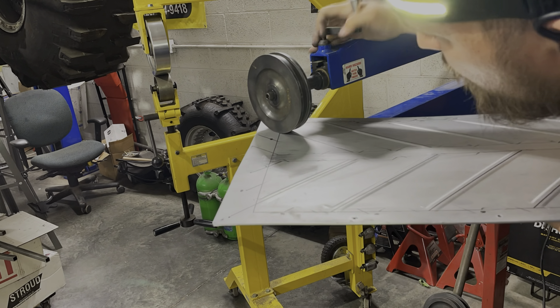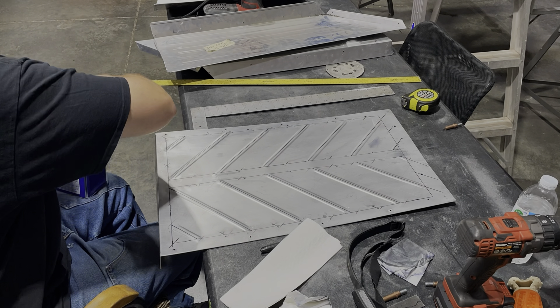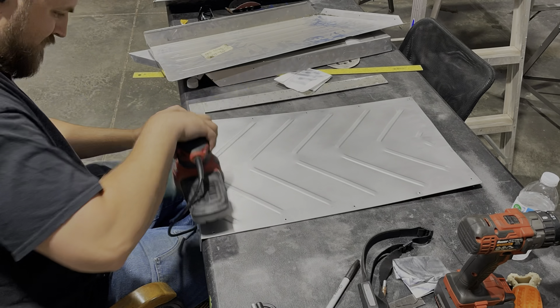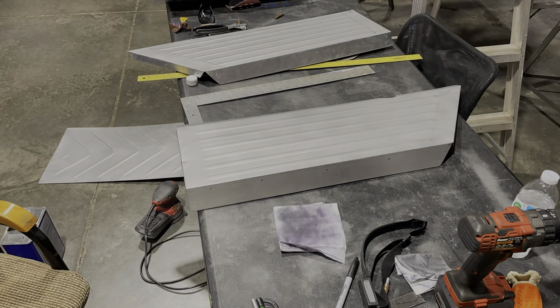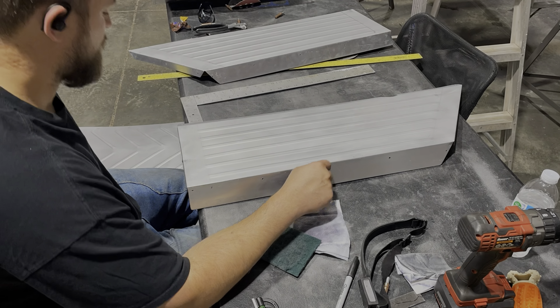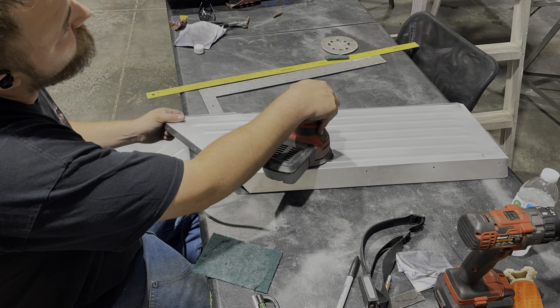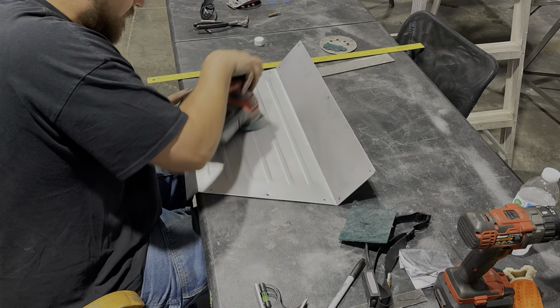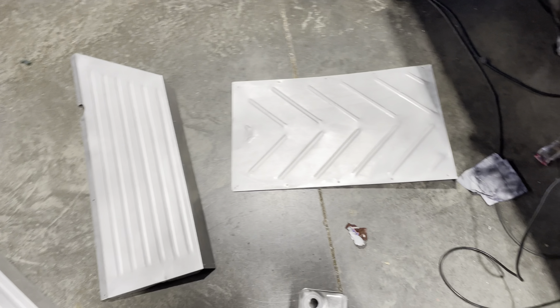If you've got a more complex piece, I definitely suggest going with triangles or different designs versus straight lines. If you've got square or rectangle pieces, the straight-line stuff looks pretty decent, or putting angles on it like this bottom piece here. Now I'm just cleaning these bad boys up, getting them straightened out — when you're done with it in the bead roller, it's best to just take a piece of scotch-brite to it, and that's what I'm doing here on the DA.